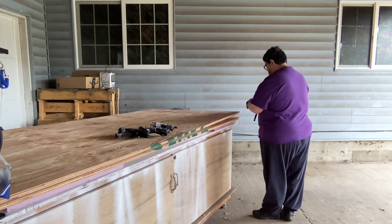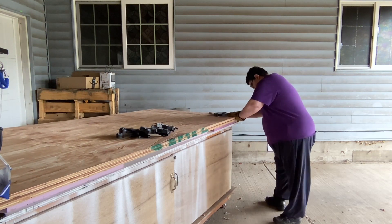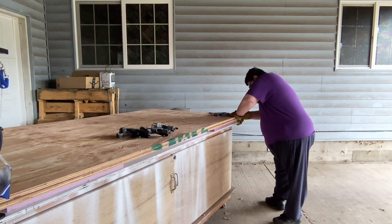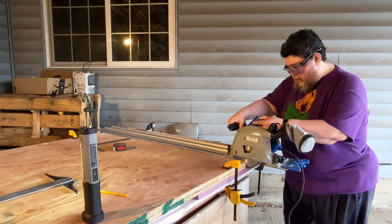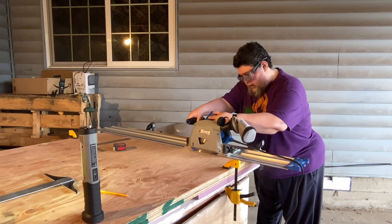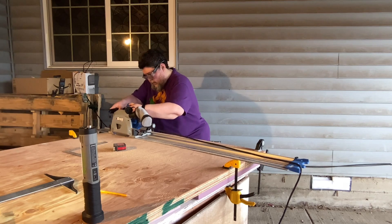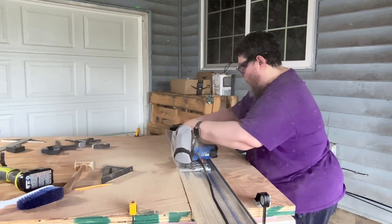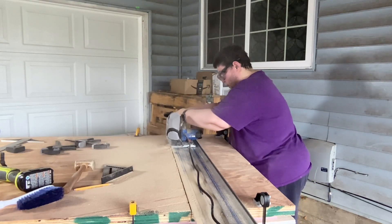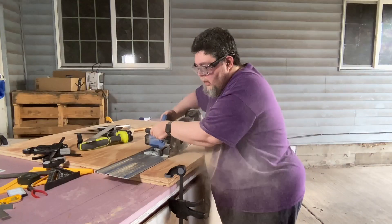Keep in mind that I'm new to this woodworking thing. The very first step in building this cart was really quite intimidating — I had never cut full-sized sheets of plywood before. The only wood I could get delivered for a reasonable price was construction grade, which was both kind of ugly and very warped. Both slabs of plywood were going to have the same set of cuts, so I decided to clamp them together and cut both at once using my track saw. I did a lot of careful measuring and made my cuts a bit oversized, intending to trim them down later on the table and miter saw. To protect the old cabinet I was using as a cutting surface, I laid down a couple of sheets of pink foam insulation so if the blade was a little too deep, it would cut into the foam and not the cabinet. Wearing my safety glasses, I cut — and no, the tiny little dust collection bag wasn't adequate. By the time I was done, I was covered in sawdust.